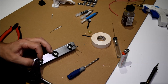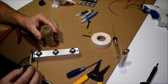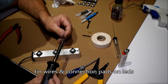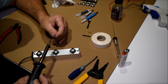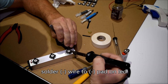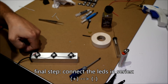Then you just use tiny little wires in between the three LEDs to connect them. On the left hand side I've got the positive — I would connect that to the positive side of that LED, then the negative of that LED connects to the positive of the next LED, and so on. The basic fundamentals of soldering here is tinning all the little pads — there are little copper pads on each of the LEDs. Put a little bit of liquid flux on the pad, a tiny drop, then just touch your soldering iron to each LED so you don't overheat it. If you have big fat fingers like I do, use tweezers for some of these connections.